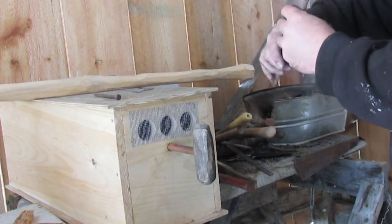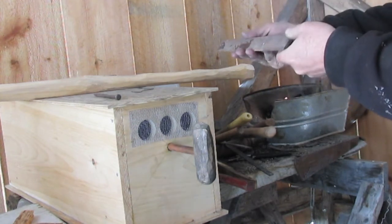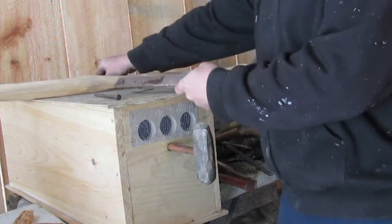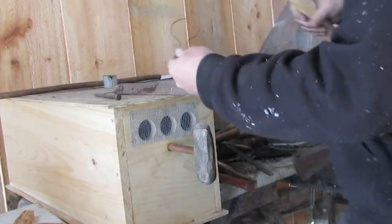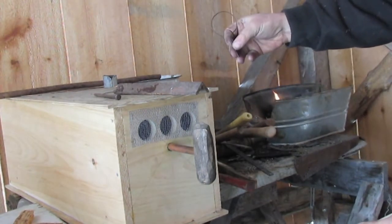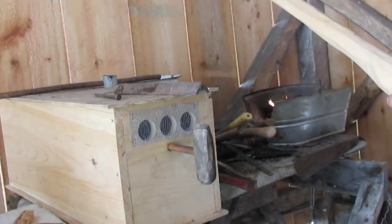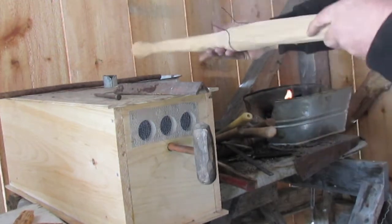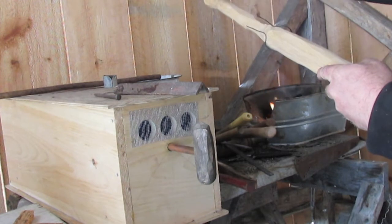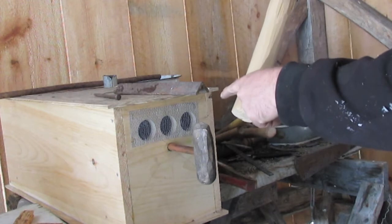Maybe it's just rolled out this way, but there's more meat at the corner here, so if I flatten it and I don't go too crazy, it should be sort of a raised section. And then I want to kind of forge it into a sort of brace band kind of shape to fit like that. And then I'll drill some holes in the sides of it that the hook eye will sit in, and then the hook will come around like that.